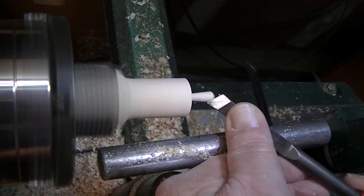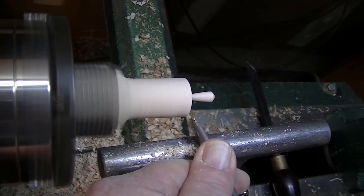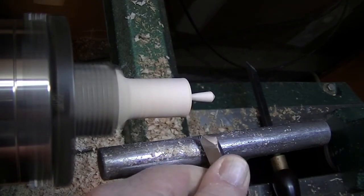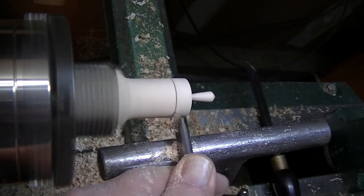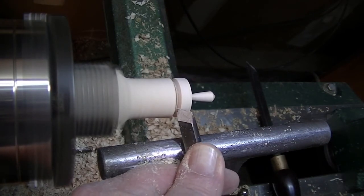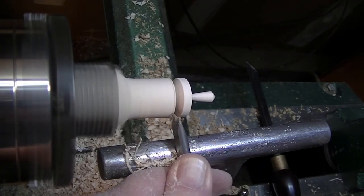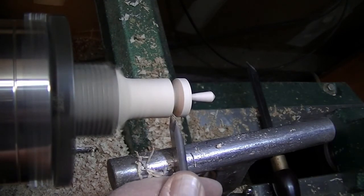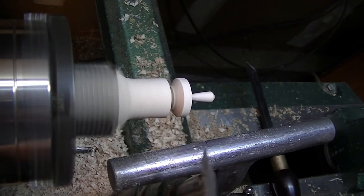And a more delicate handle. And we've got a facing cut to clean that mess up down in there. That's pretty tiny. So let's go back to doing our V-cut. Staying with my smaller one here, just for fun. I went to the left side simply because I felt I was going to need more clearance. That cut was deep enough, it worked on the maple. It would not have worked on that oak.